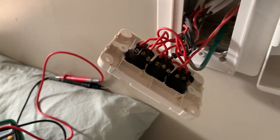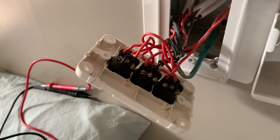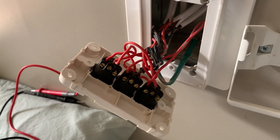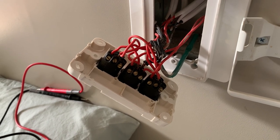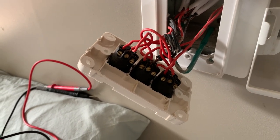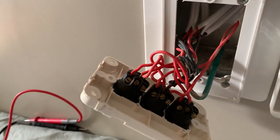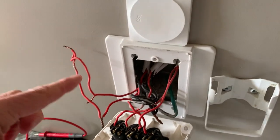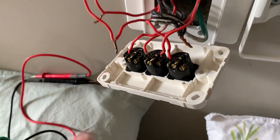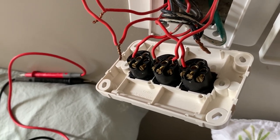For this switch, I will just close the circuit and leave it there so that the middle switch has no effect. I'll leave the other switch at the door as the one that controls, so the Lifx switch won't handle two-way switches. So I'll just turn it into a one-way by closing the circuit there and then popping the switch into there. So I've disconnected the cores, which is the center of the switch, the power in, and I will feed that to the